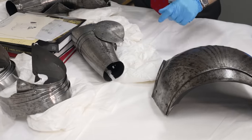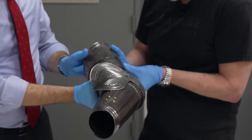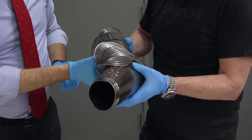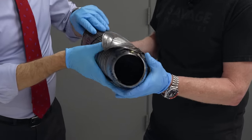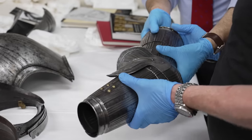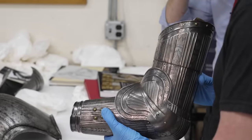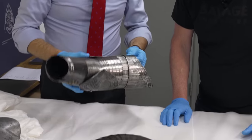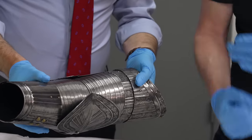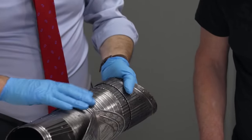A bit later, at the same time this armor is made, they have a new way of doing rotation. It sticks a little bit because you could oil it a little more, but it is actually impressively smooth. It's flush — you don't see how it's done. On the inside, you have a system of a plate that acts like a catch, and then the other one is caught by it, and they just grab each other and one rotates into the other. They used the same system to cover the inside of the arms — this is almost always a gap in armor — and here they decided to completely close it. It's still very much like a lobster tail in terms of function.